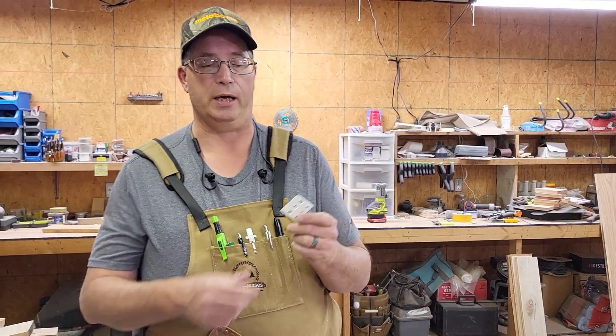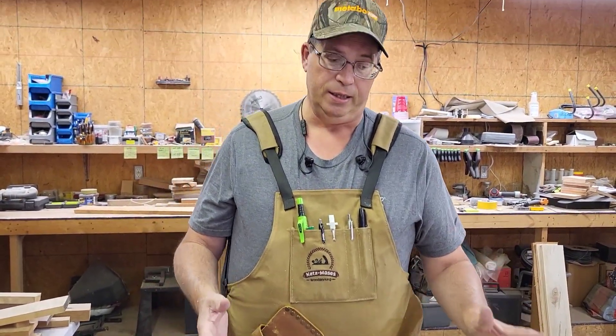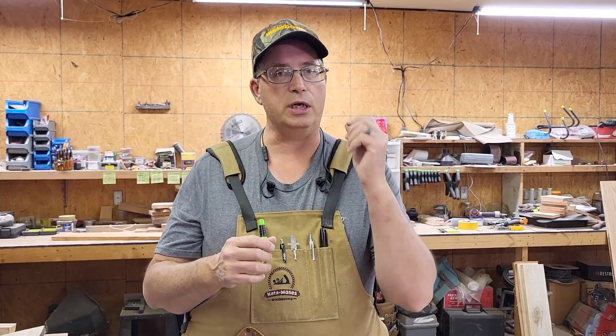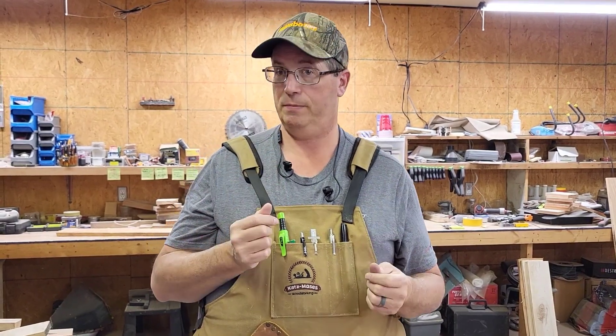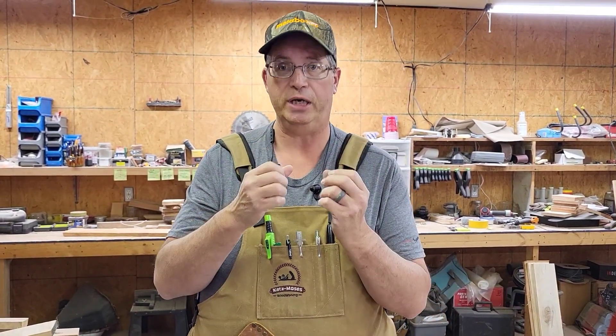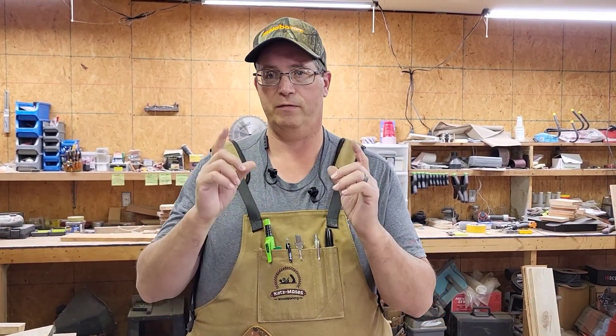There you saw it — open it up just enough and it's smooth as butter after that. Back in the pocket for the next time. Pay attention to your saw: you can hear the sound even with your ISOtunes or hearing protection in, you can feel it, and sometimes you'll smell burning because it's binding and burning. When those things happen, your cue is to turn off the saw, figure out what's going on, fix it, and then proceed. Be safe in the shop — thanks for watching, and remember, you can do this.